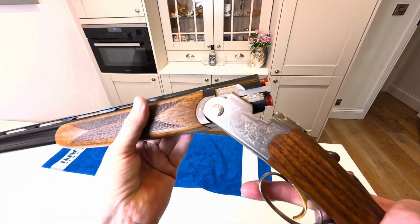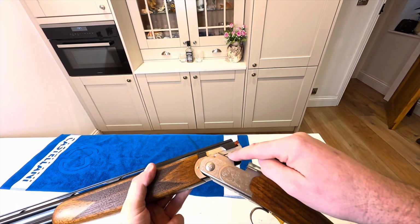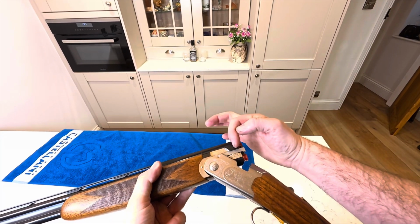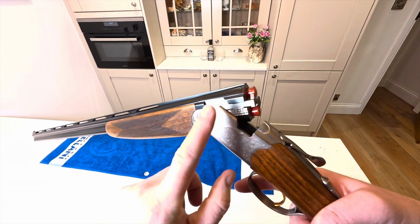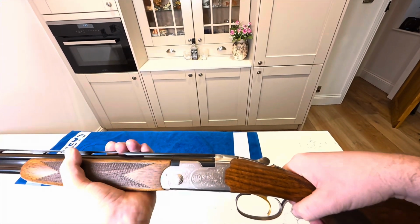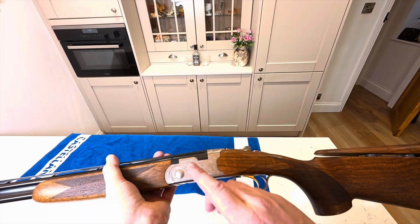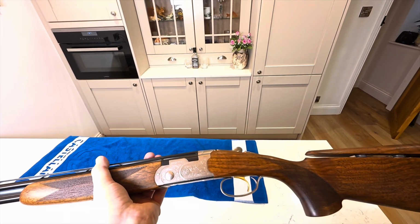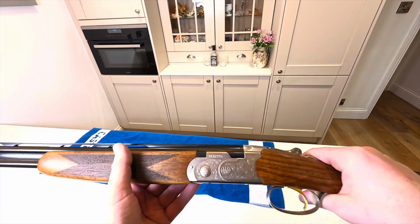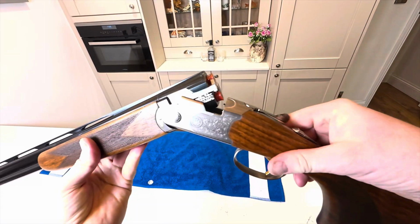So the recoil shoulders on a Beretta is basically this part of the action. We can see the machined curved slope cutout down, and then we can see this lump here on the side of the barrel wall. So when the gun is closed, that now is against this fence. So not just the pins are taking the recoil, and again the gun can't separate forwards because the recoil shoulder on the Beretta is stopping it from coming off face.